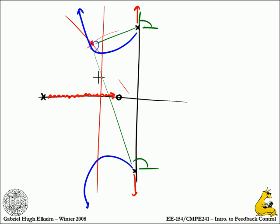I'm doing all right. As I said, if I move this zero into the right half plane, then strange things start to happen. From the math, it's all just fine. But if you actually go all the way through and do a step response to it, you will get something very unlike what you think you ought to be getting. Right half plane zeros are referred to as non-minimum phase zeros, and they're definitely something to stay away from. Okay, so they're a bit bizarre. However, as I said, I can get my system to go through this point, and I'm doing fine, as long as I do this.